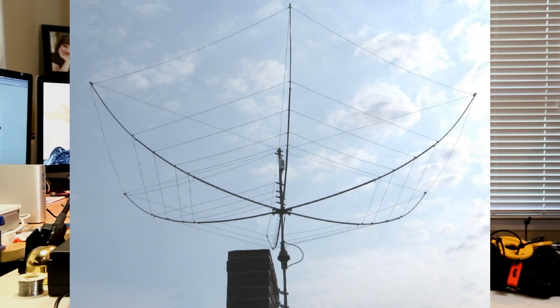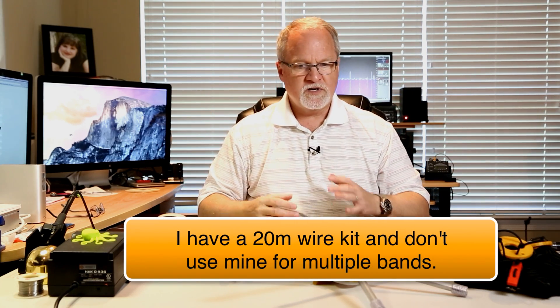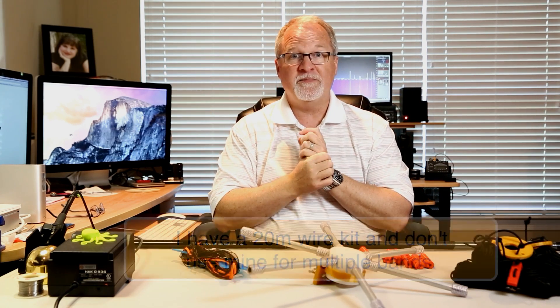It's a great antenna. A lot of people have them at home — a multiband hex beam where you have wire kits stacked up on spreaders that are bent. This particular one I built, the spreaders just lay horizontal and the wire kit goes around it without them being under stress. So let's take a look at how to build that.